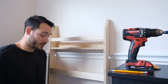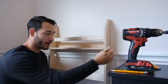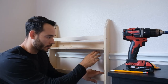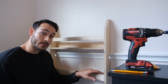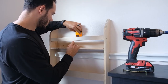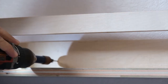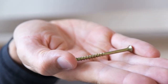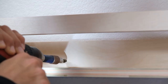All we need to do is make sure it's really secure down at the bottom, which I've already done. It's all the way against the wall and I just need to find out where my studs are. I had to cut this little recess in the piece here so that it would fit around my wainscoting or molding. So if you have any of that in your house, or say you have higher baseboards, you need to make sure you account for that when you're building this thing. I'm using a basic two-and-a-half-inch interior screw, and I do like to use the T25 screws so that your bits don't strip out.